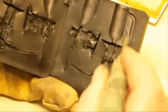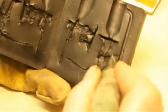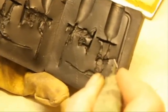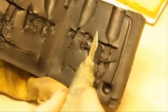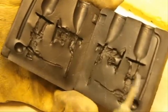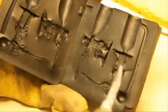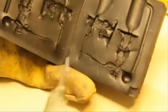Study the mold. Any points that are above the bottom of the ingot are primary targets for vents, especially the narrow areas like the sword scabbard. Our toolmaker shows here several points of concern that could be vented, including the highest point of the base, the scabbards and the bayonets. All vents go towards the top, or at least upwards.